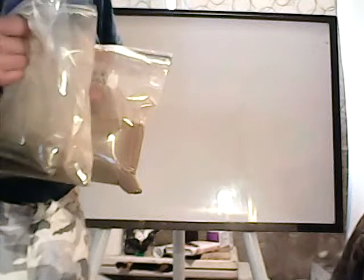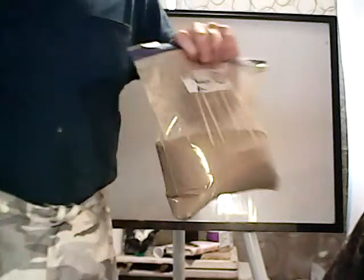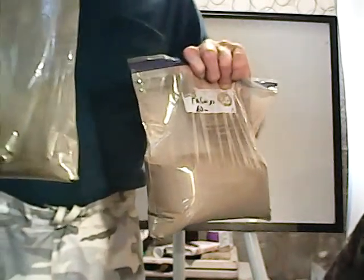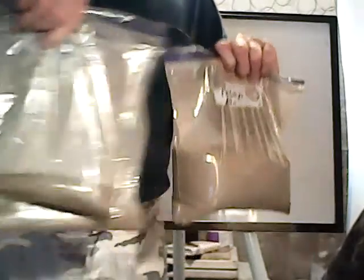On the other hand, with the tailings, because this is after the stuff has been run through the mill, the agitation tank and stuff, and this is not the slimes. This is your 60 mesh minus, and there's your 35 plus, and there's your 35 minus. So you can see this is a much finer grind.